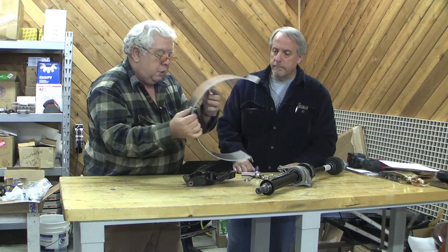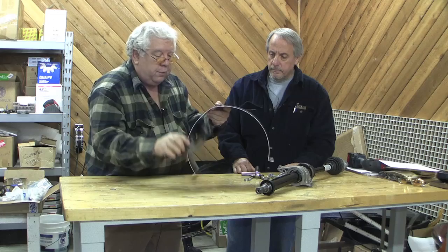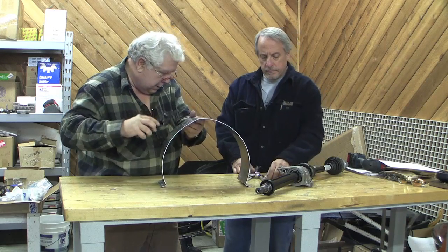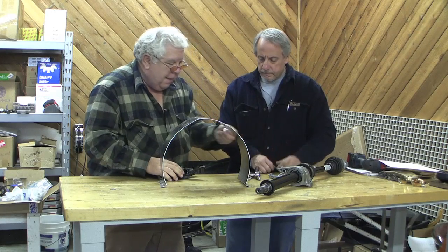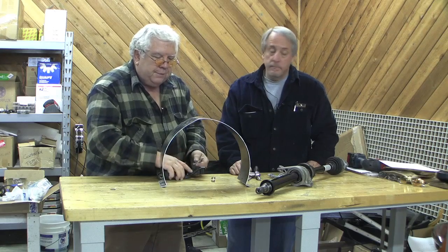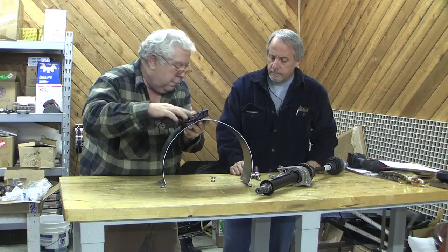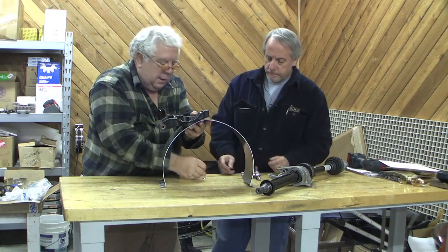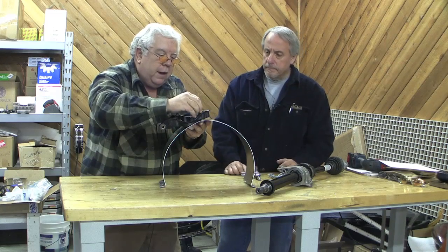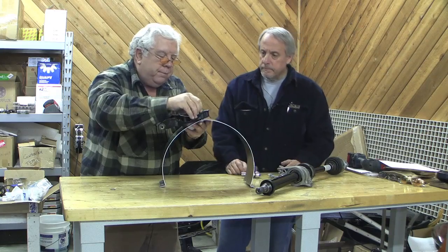It's five and a half inches wide, which should accommodate the bracket. We drilled a couple of holes in it for the two top mount bolts on the bracket. This bracket affixes to our belly band with a couple of three-eighths inch bolts. We cut them to length, with a washer and a lock washer so it wouldn't interfere with the bracket or the drive shaft, and we just put those on about like that.